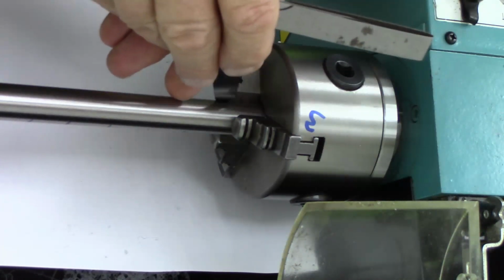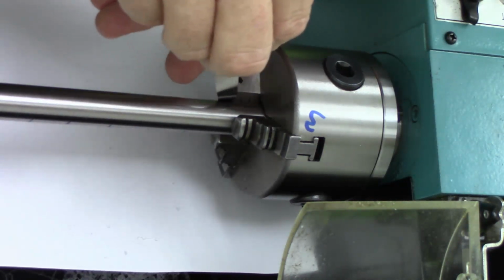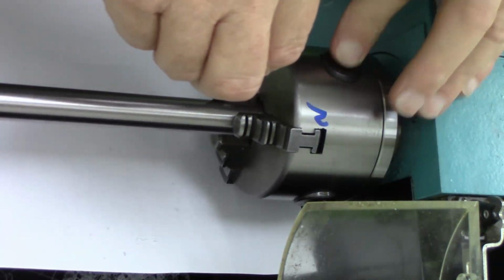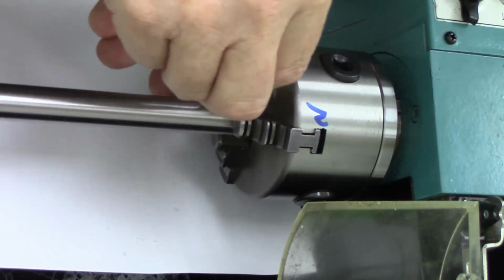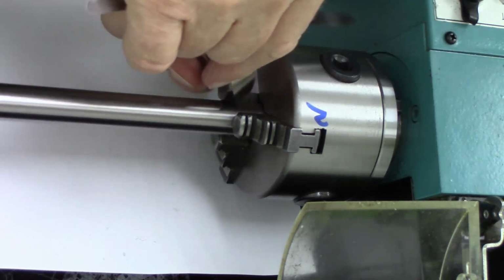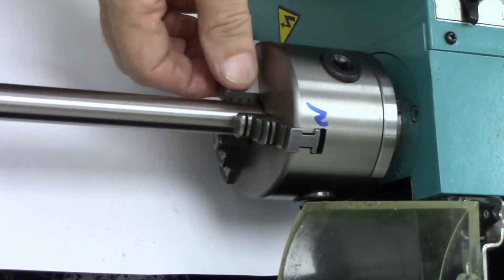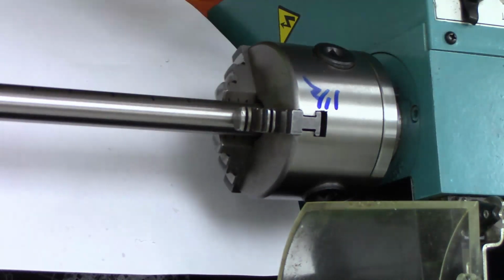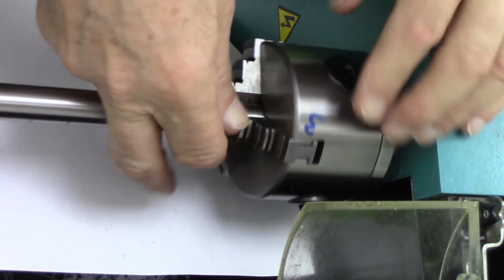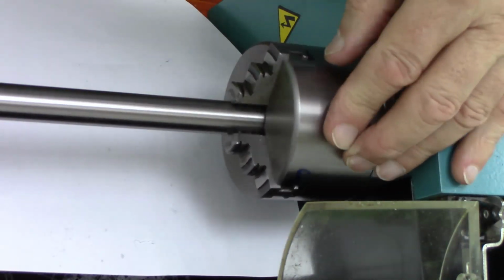and this one I can get a 2 thou shim past. Yeah, that's 2 thou. And this one perhaps not 2. What's that? This is 1.5. Get 1.5 past that one. So it's 1.5 thou. So these leading teeth on the front of the chuck are not engaging. Well, I hadn't noticed that before. I don't see how I could fail to have noticed that.